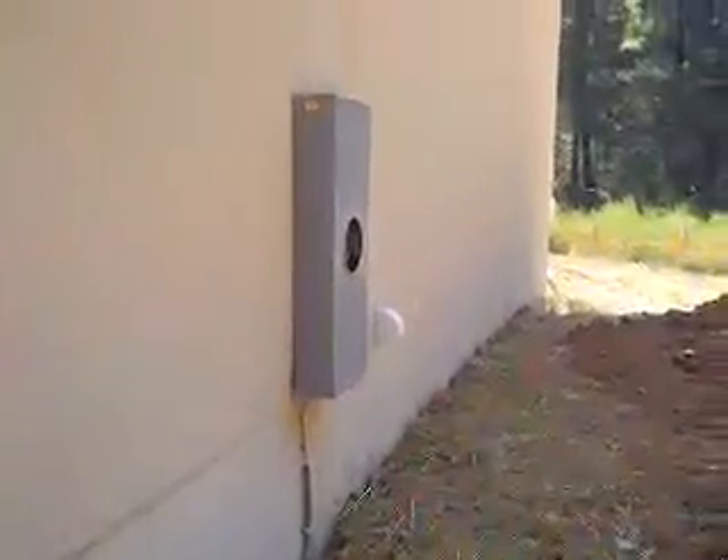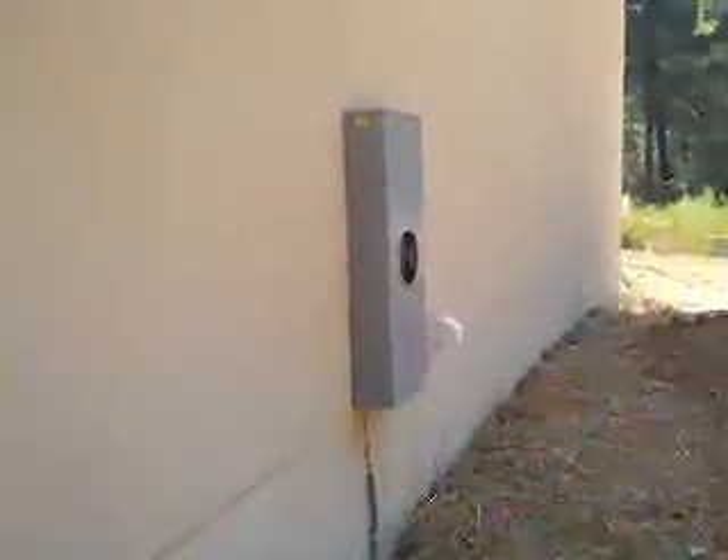On the four side, I went ahead and put a third acorn on it to bring over to my phone and cable, and put a ground clamp right there. That way they won't have to run their ground all the way across the wall, because that area doesn't access the crawl space — that's why we put the cable over here.